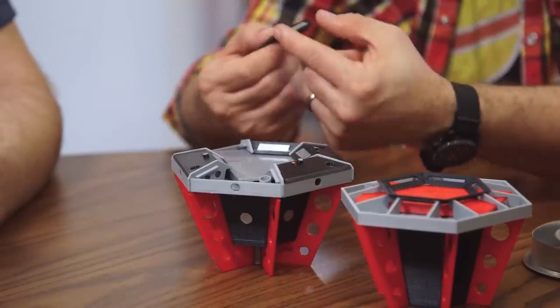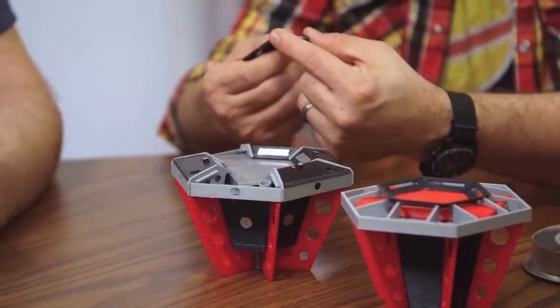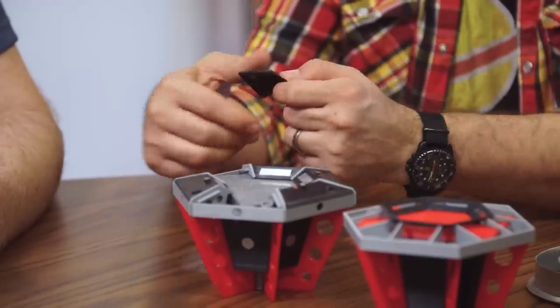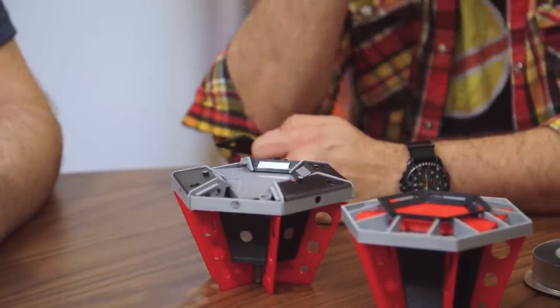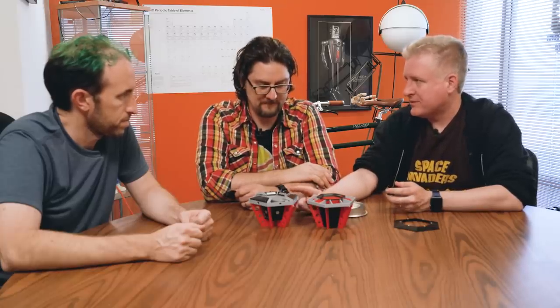There'll be an additional cleat at the front. The front panel will be acrylic because it's going to have lights in it — the silver part that clamps on separately, then the inner ring goes on separate. The acrylic will have a little more give; the side will be wood — plenty sturdy. We're doing three-quarter inch lightweight MDF. The whole thing is being done in that same material, which is a lot like what arcade cabinets were originally made out of — though not lightweight like this. You give up a little strength but it's so much lighter.